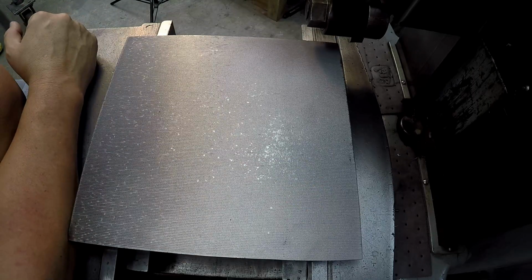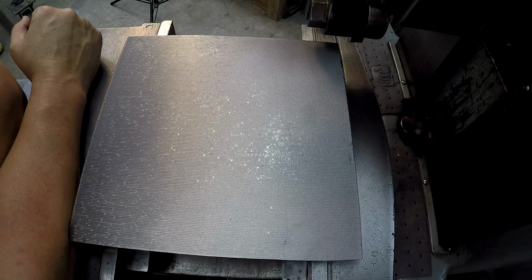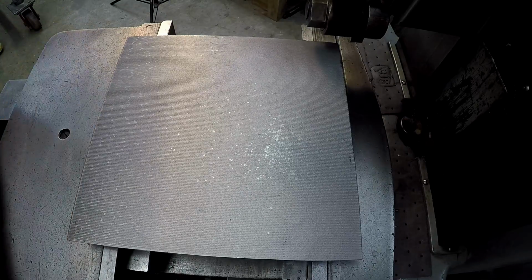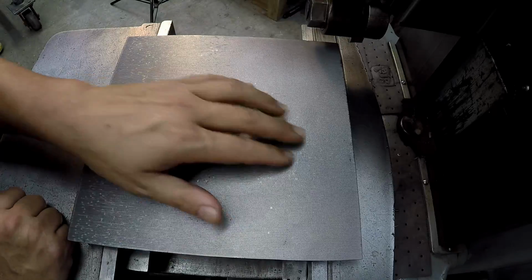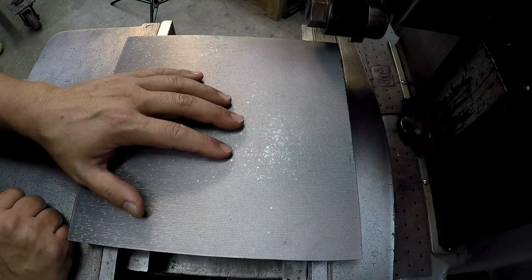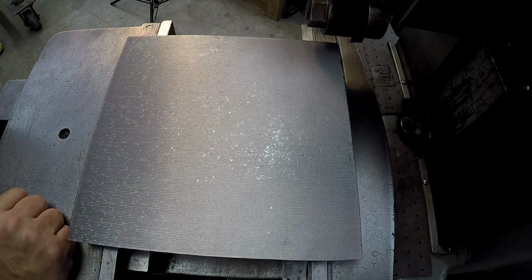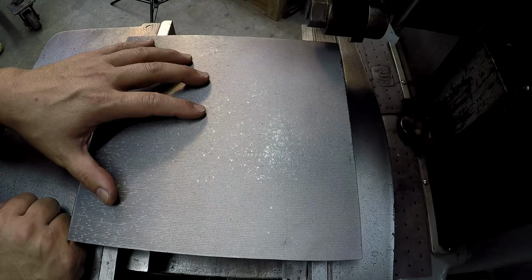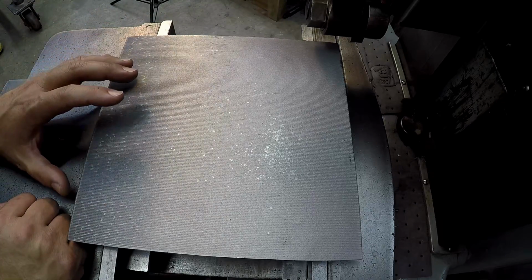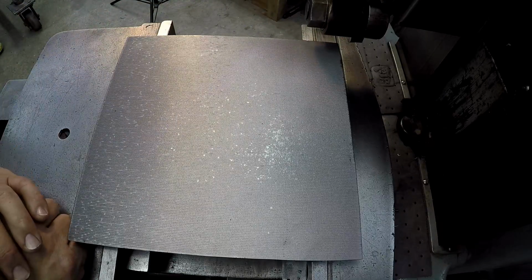Okay, so you guys over on the milling machines that are using indexable face mills, a lot of times when I see cuts that have been made with those face mills, I don't like the way the finish is. It's got a terry finish, and then you have drag on there too. I think this is a really cool finish, very pretty, and when done right, it looks top notch. So the benefit of what I'm getting at is that you can still cut a large area in a short amount of time, okay? The other benefit is I'm using a cheap high-speed tool bit versus expensive carbide tools.